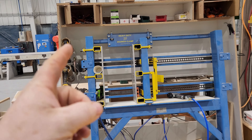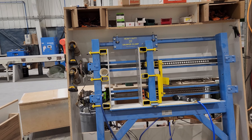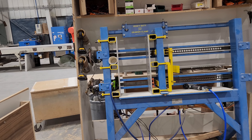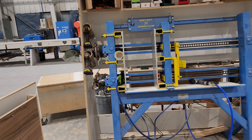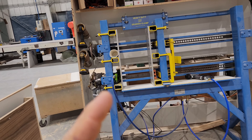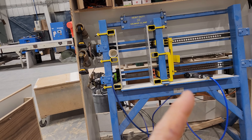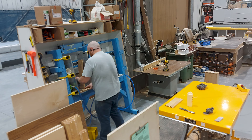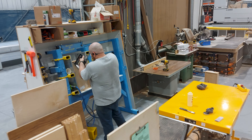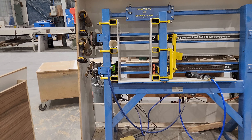Here's the dovetail assembly area - we keep everything we need in this area. I've got my undermount clips, lefts and rights, all my nails, two drills - one is a driver with a bit for the screws, the other is a drill with a pre-drill bit. We have a nail gun with a half inch staple and another stapler for stapling in the bottom. As I'm assembling, I'll pre-glue the pieces and throw them into the clamp.